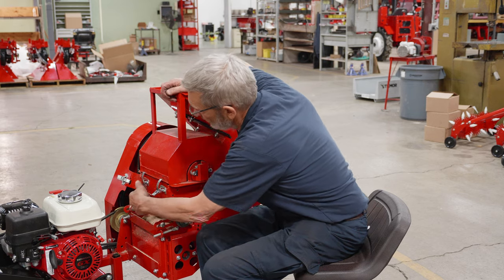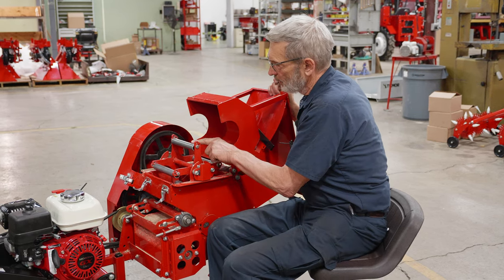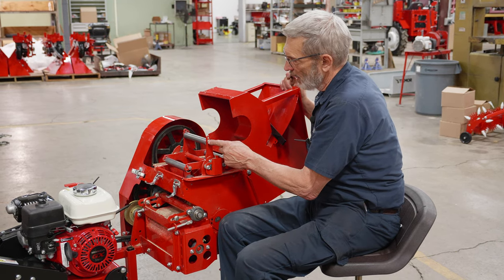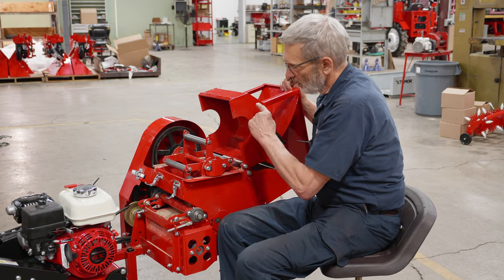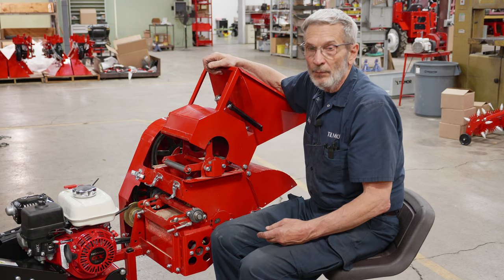You may also want to experiment not only with the screen size but you can actually put these pipes in different positions. We had it in the middle position for a while; I now have it in the third position and we had a little less breakage at that point. So you can live and learn. It will arrive in the second position.